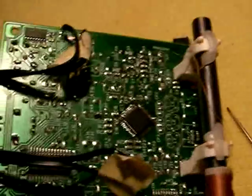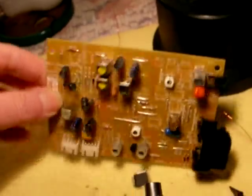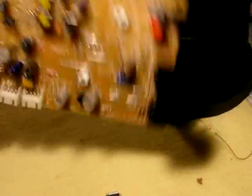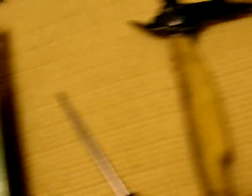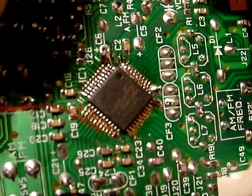But I'm just thrilled that it's working again, and it was this chip. I was fortunate that was the only chip I had. How lucky can you get when that's the only chip you happen to have? I took it off of this spare tuning board from an old junk Philips compact shelf stereo from 1999 that had a bad CD player. I saved the tuner module from it because it also used the I2C bus and had the same chip — the TEA5757. I was very careful to take it out. I remove surface mount chips with a piece of magnet wire. Slide the magnet wire underneath the legs of the chip, then heat each pin with the point of the soldering iron while pulling on the wire. It pulls the pins up and away from the board without damaging the board. Then clean it up and put in the new chip.